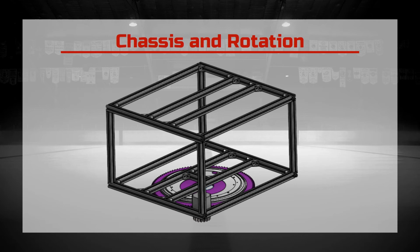The last mechanical component is the chassis, which is built to house and act as structural support for the other components. The chassis is fully built from aluminum extrusions, which have a high stiffness and strength. We calculated the deflection that could occur on an extrusion under a full load of the robot, and it was less than 1/100th of a millimeter. Using this material allowed for simple assembly and deconstruction, which is very useful while adjusting the alignment of components.